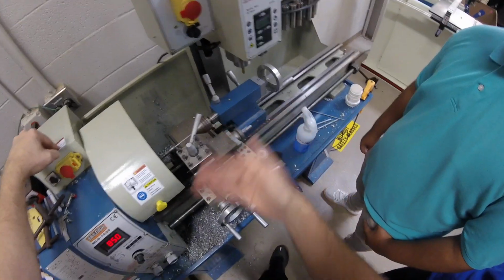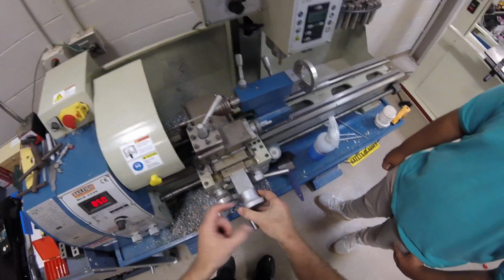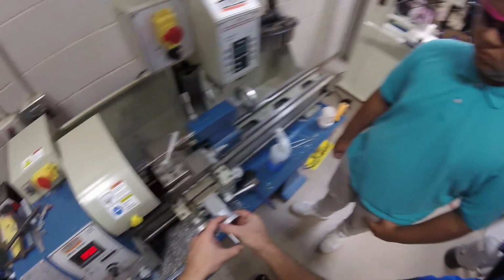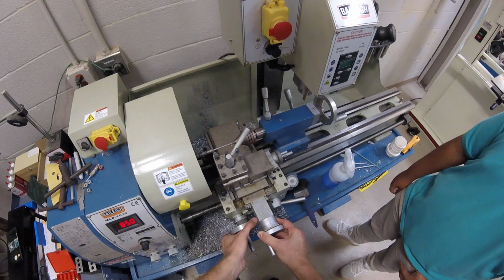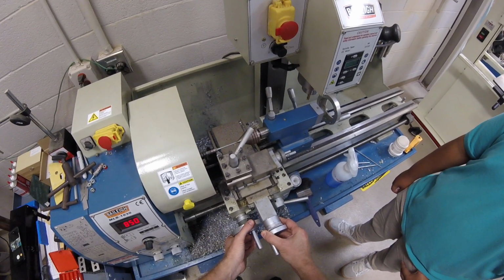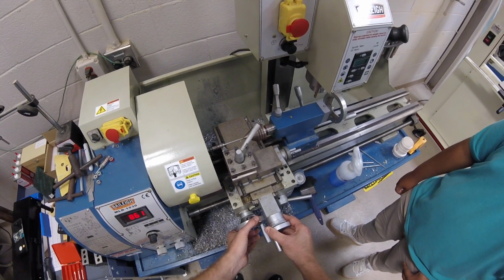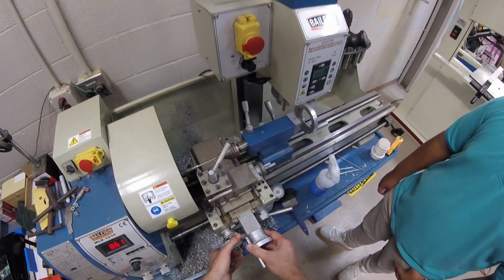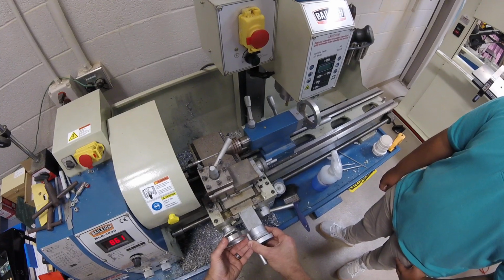We're going to have to use our Z pretty slowly due to the fact that we have an axle in there that has a little bit of flex. So we're going to first go in 10 thou, okay? I'm going to hold my hand on this. Remember, I zeroed this, and I'm going to take my first pass. I'm going to go slow. If we go any faster, you're going to see too much flex, and it's not going to make a nice cut, okay?